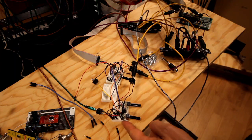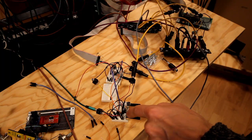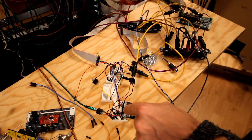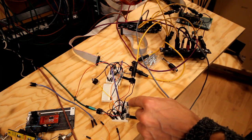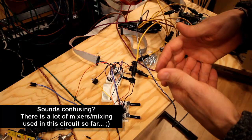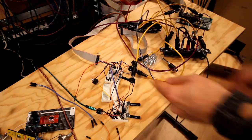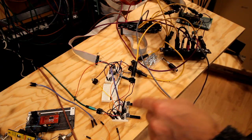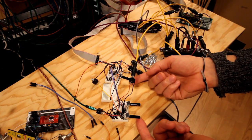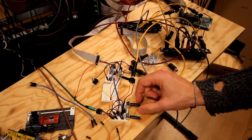Alright, so here is the new circuit. As it is configured now, it is configured as an inverting mixer with the input. So instead of just having a pot on the input, I actually have it connected as one input on the mixer. And the second one is coming from the output of the mixer that mixes all the taps and the mix together. So we have the mix pot, the input pot and the feedback pot, and the mix pot is around 50%, this one is around 30%, and feedback is now 0.